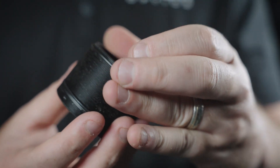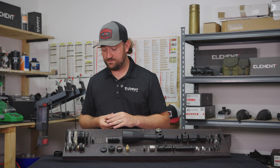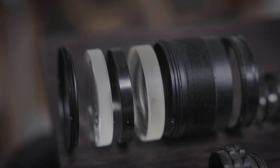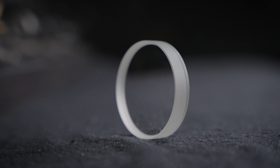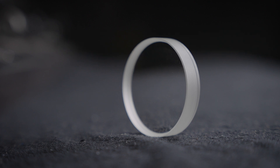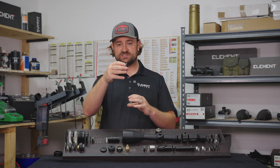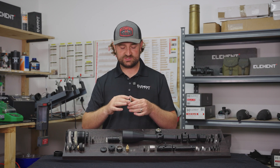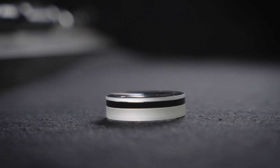Breaking it down further, we start to see some really interesting things as we assess how different optical systems have different objective assemblies. On the Titan, if you look closely, you'll see what at first looks like two lenses separated by a spacer ring — but if you zoom in, you'll see that each of those two lenses is actually made up of two lenses glued together. Looking at a Helix objective assembly, you'll see it looks quite a bit thinner. It has a smaller spacer ring, two lenses — one is a single piece of glass and the other is two pieces of glass cemented together.